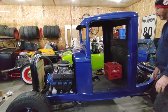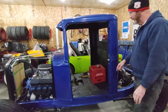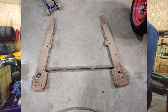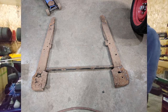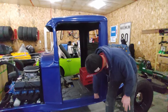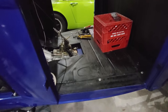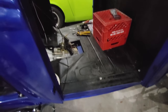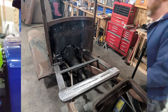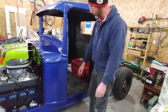I went to the process of taking the subframe apart and building a new subframe for it. I could have ordered one, but I really wanted to make as much stuff as I possibly could myself. It's mostly made out of an inch and a half square tubing, which I welded together. We'll insert the pictures of how I did that. The subframe was basically tied into the cowl and bolted to the floor.